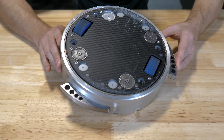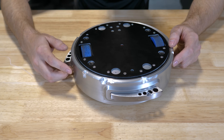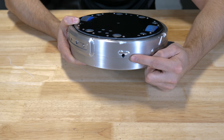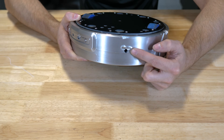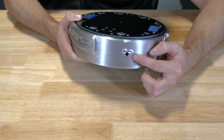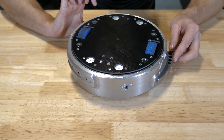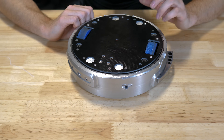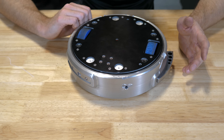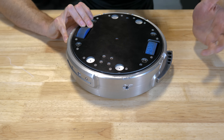There's a lesson learned there, but it is nicely chewed up. There are also some nasty gouges on the side — Dropkick was fairly responsible for those. I had to drill out the hole for the safety pin that stops the weapon from spinning, because after one hit that pin wouldn't fit anymore. You'll also notice I've got G10 on the top here instead of carbon fiber. I did end up with a little extra weight, and the G10 didn't seem to have as much radio interference as the carbon fiber. If you guys know anything about how carbon fiber affects radio waves and signal attenuation, let me know in the comments.